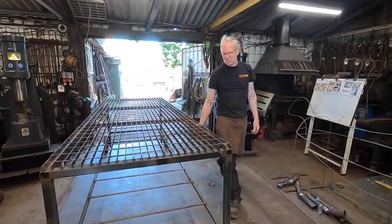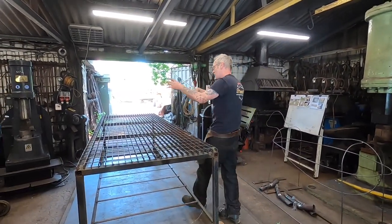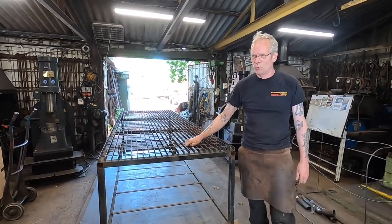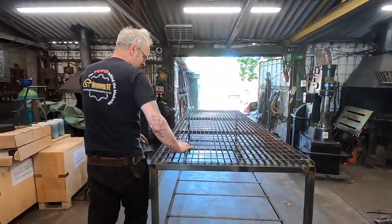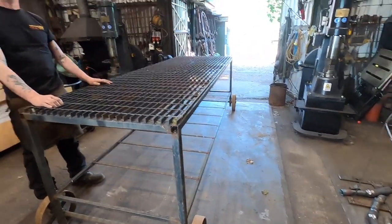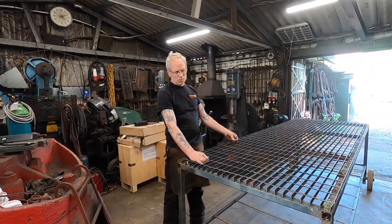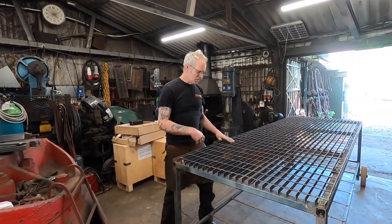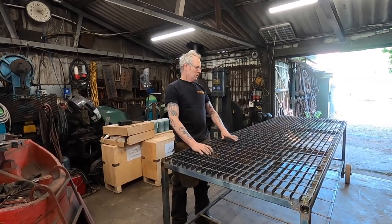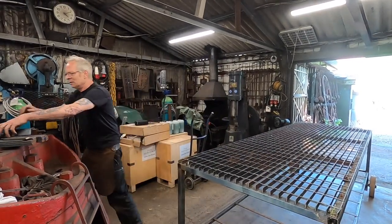Right, I left my bottom shelf empty because I'm going to weld on it. We have welding screens that sit on here — when I'm teaching welding I have screens on them. But when we're welding up stuff and we don't want it to move, I use this. It's brilliant because I've got hurdle wheels on here — it's all iron. The plate's earthed, so when I weld on it the earth comes through. I'll put the earth on the job we're working on but it will also earth through the floor. And all your welding spatter drops through — you don't get lumps of spatter. If you use a flat plate, you don't get a good earth and it builds up all over the place.